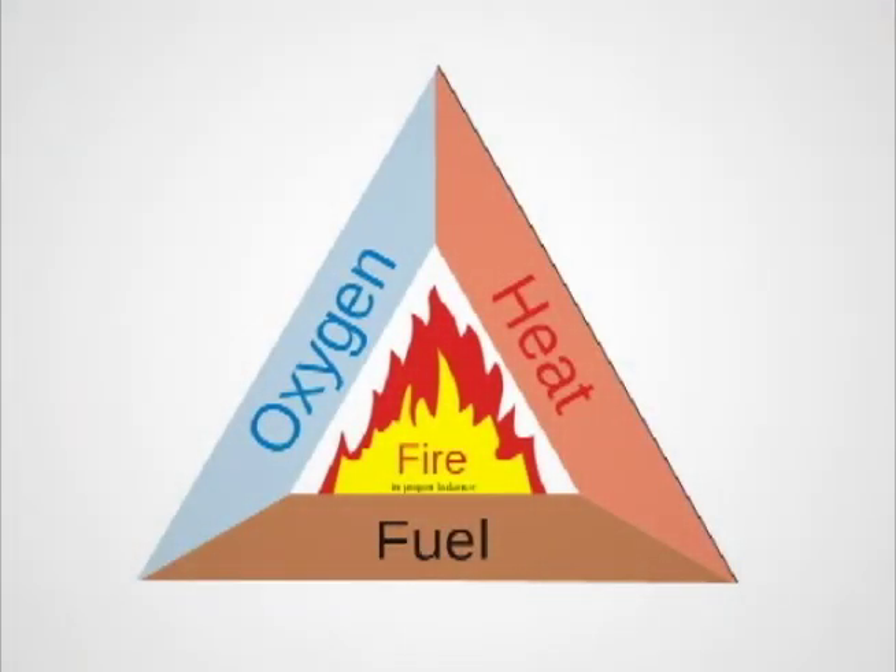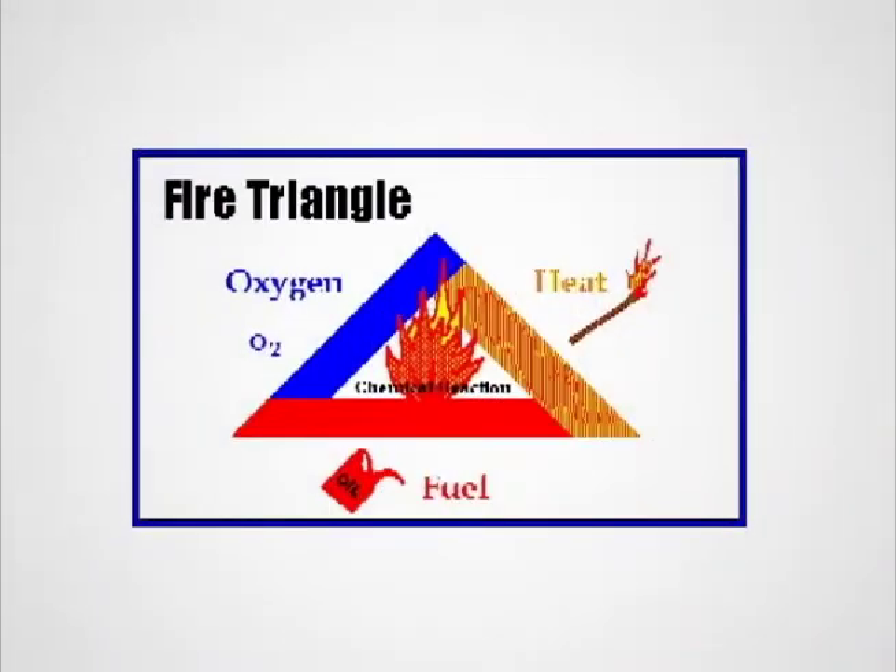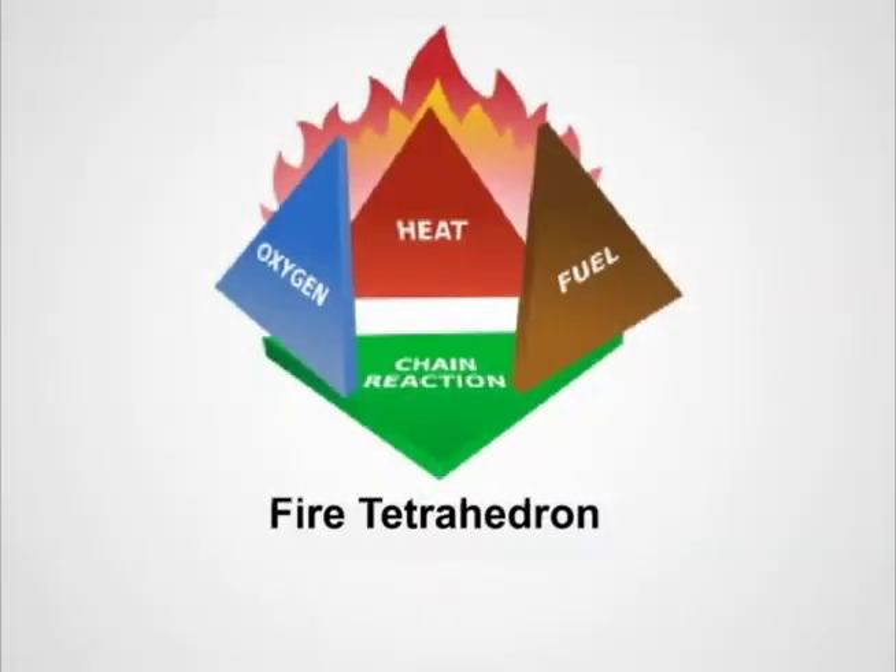Take a look at this illustration. We should all be familiar with the fire triangle — it shows the three basic elements of a fire: oxygen, heat and fuel. If we remove any one or more of these elements, the fire cannot sustain itself and eventually goes out. In a manhole or vault, this generally doesn't happen until fuel or oxygen is consumed. What the fire triangle doesn't show is a fourth important element: the chemical reaction that sustains the fire. This chemical reaction is just as important as oxygen, heat and fuel. STAT-X agent works by interrupting the chemical reaction of fire, intercepting the free radicals created during combustion, thereby stopping the pathway necessary to complete the fire chemical reaction.